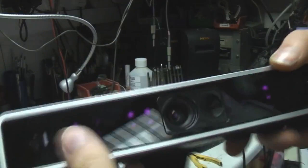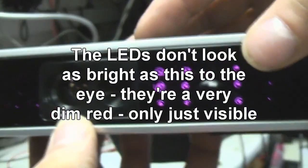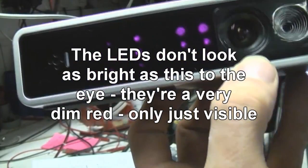On the front there are two little microphones on either side. There's the actual sensor — one obvious difference from the Kinect is it's got a very big lens. There's a standard fairly low-res RGB camera as well. And the front also has the infrared illuminators. You can see there are two banks of 12 infrared LEDs on the front.